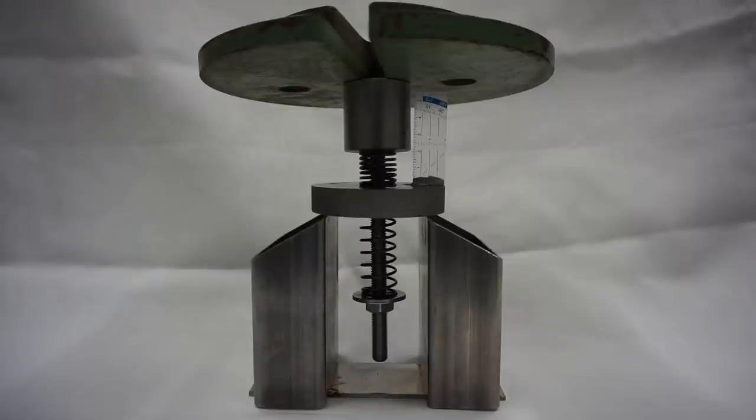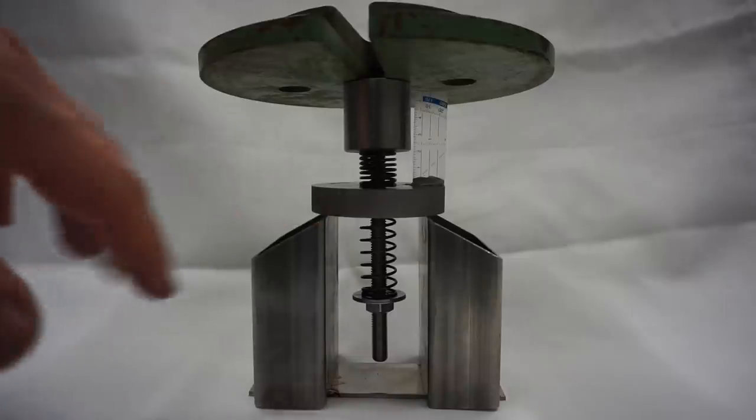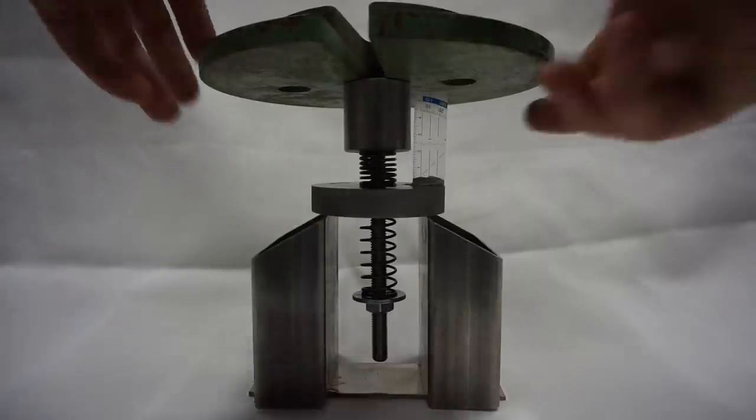To my younger self, back in the day, this was very unintuitive, since the bearing stiffnesses, these two, are still the same. So how can it be that the system becomes more rigid by preloading it? Frankly, the principle is the same as when you tune your guitar. As you tighten the string, that is, you increase the preload, the vibrational frequency gets higher. This is because the rigidity increased. Just like here.